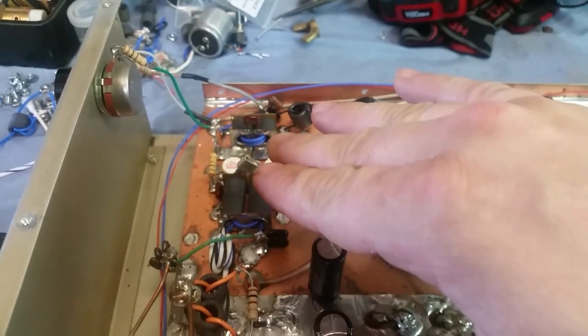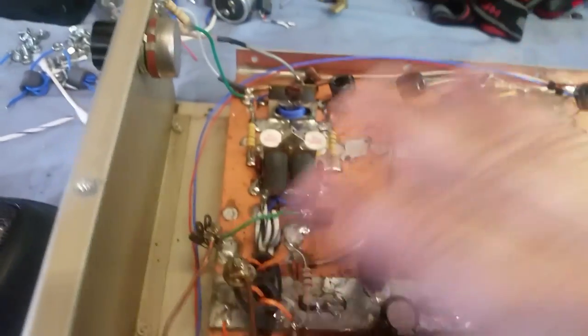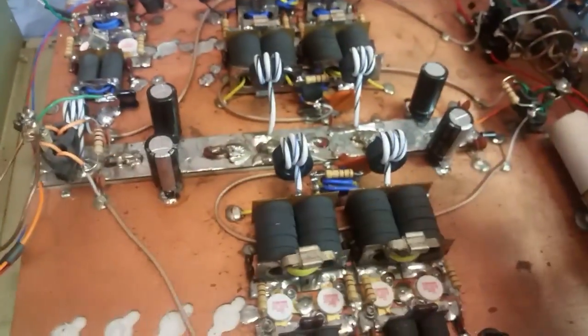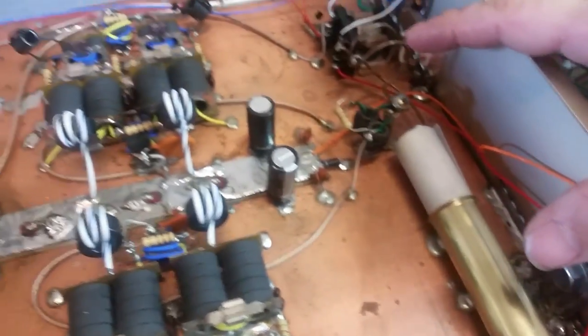I actually checked the 2-pill section independently. That's the first thing I did do, just to make sure it was tuned just fine. Then after that, I rechecked the tune, which was Dave's tune, the impedance matching network for the 2 4-pill sections. Spot on, man. Spot on.